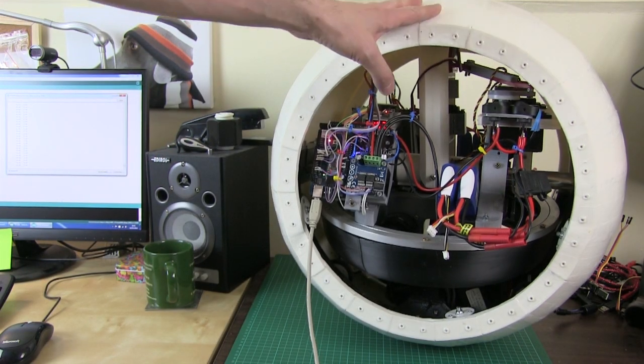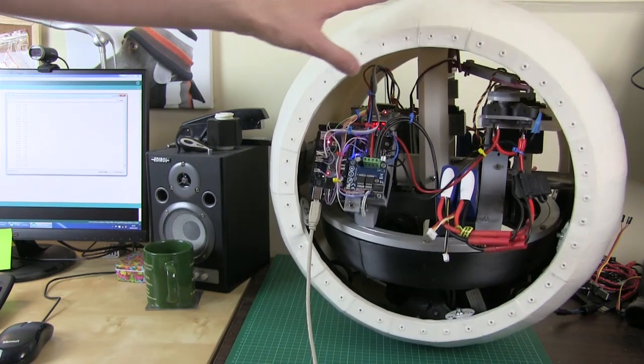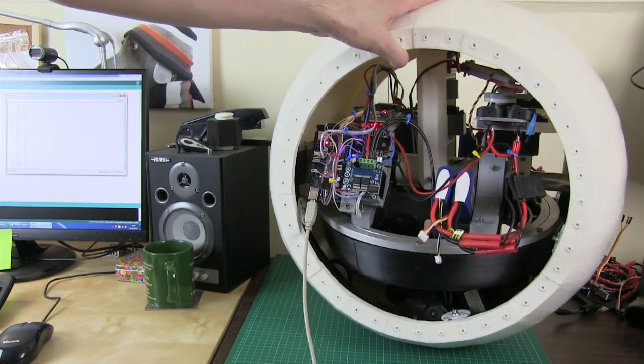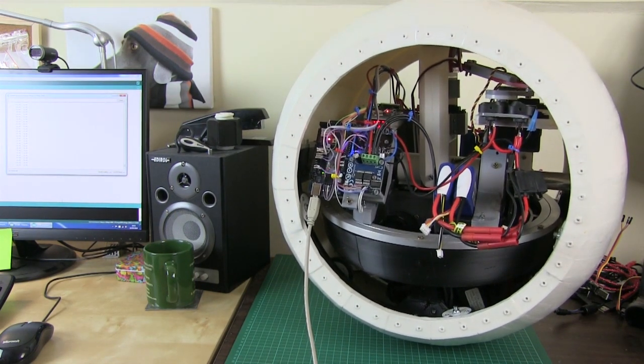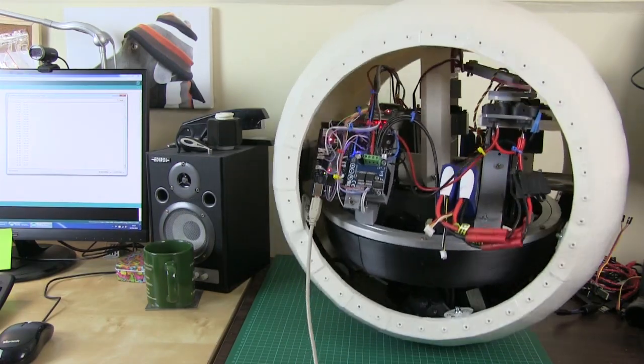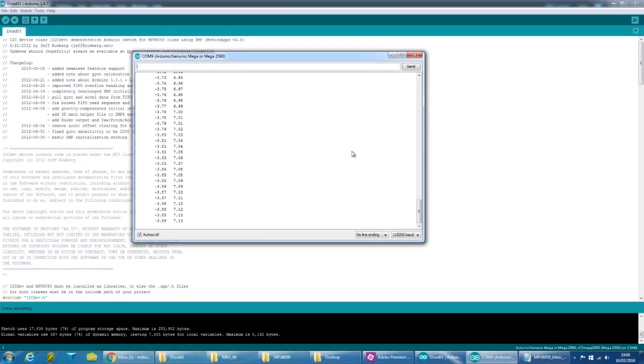I've moved the droid next to the computer on the table. The tabletop is delaminated, so any creaking sound isn't the droid breaking. I'm running the same MPU6050 code I showed last time — I've got X and Y coordinates showing on screen there. As I move the droid around, we can see the data changing. Here running that code again, if I move the droid we can see those axes vary — positive about 20 degrees, negative, and the other axis, plus or minus 20 degrees. Obviously it goes to 90 degrees either way, which hopefully we won't achieve.